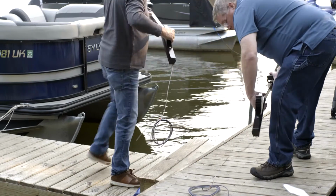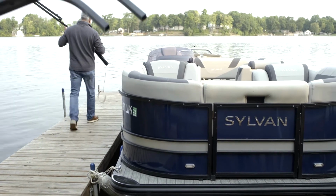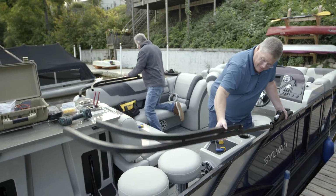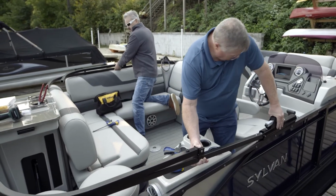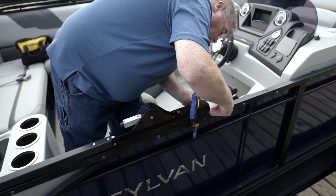The proper position of the right rear strut/actuator assembly is generally determined by locating the assembly so that when the top is down, the struts are just behind the rear seats. Too far forward and the top will interfere with the rear seating, while too far aft will provide less shade to the front of the boat. When you have it properly positioned, use a pencil and trace a line across the front of the actuator.